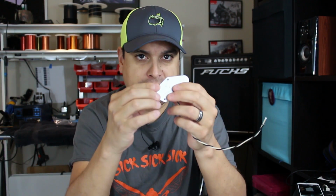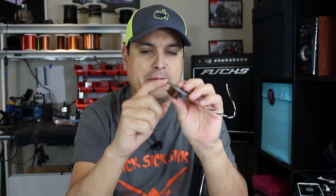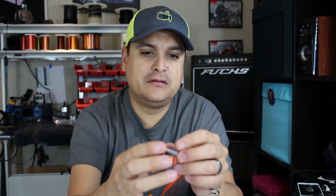Very briefly though, I'll use two pickup examples of why we do. One is a Telecaster pickup. Obviously this metal plate that is on the bottom here, you can reach the resonant frequency of this plate and the thing causes a squeal. I mean, that's basically what happens, right? So if you have wax between here and the bobbin, it will dampen that problem and it will make it to where it doesn't squeal.